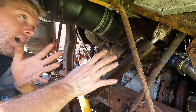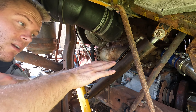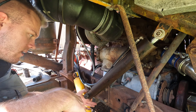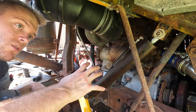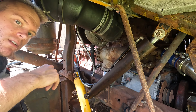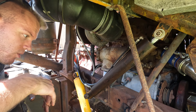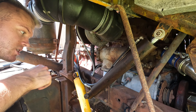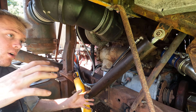Not for historical reasons — it would just be a pain and it would be smarter to remove it from the truck to actually attach it. Whereas if I leave it like it is, I don't have to change anything. This style base mount — a pin eye through the body — is really more of a custom option. You can't truly get this type of cylinder with this base mount without going custom, especially with this body length and stroke. So I had to go with a cross tube design. I thought about going with a weld tang, but a weld tang is not wide enough at the base and would not be strong enough.